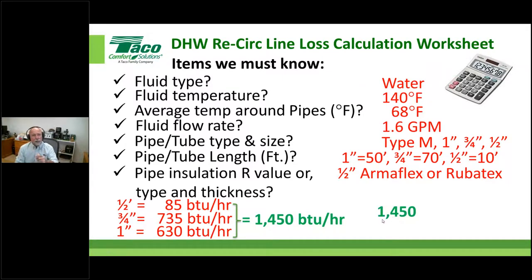So we do the universal hydronic formula, and we throw that at a 10 degree delta T, which is fairly common for what we do in the world of domestic hot water. I will say this, though, that number will tend to tighten up from there, not widen. So you might see some people doing designs at a 5 degree delta. Okay, it's all in the design of the system and what you want to achieve out at that last fixture.